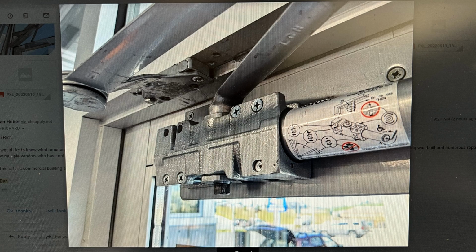So the dome style is not a good idea, because you really have only one point of mounting to the ground, and while there are two holes that you drill, there's only one fastener. So I'll recommend something that will likely need one or two new holes. When there's one screw, it's going to get damaged. There's a United club in O'Hare that I'm in all the time, and that single doorstop has been broken for months, if not years, because it's high abuse, high use, and there's just one fastener to the floor. So I'll send you something you should use for this application, and you won't get called back for it failing.